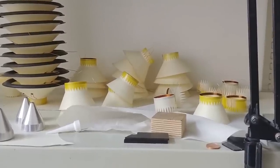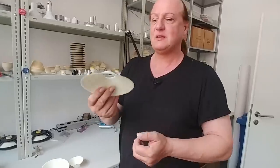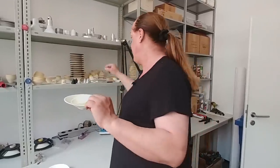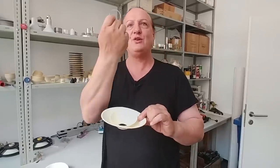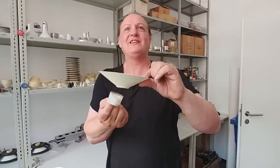Over here you see all unassembled driver parts. This is a paper woofer cone — we have a cutting machine that cuts it from Japanese calligraphy paper, then we glue it, steam it to get the structure, and paint it to make it insensitive to humidity. Then we glue it together with the other part made the same way, along with the voice coil. That is the heart of our driver, and we make them all by ourselves.